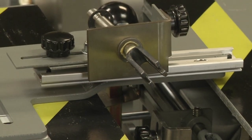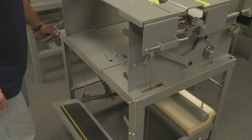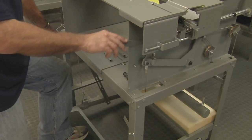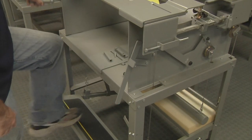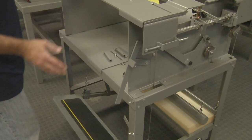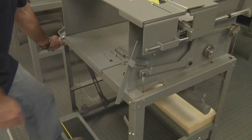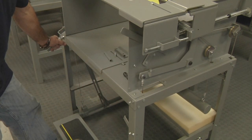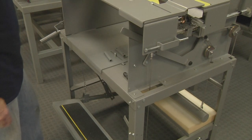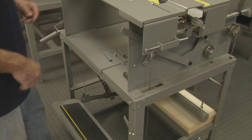This is a 24-inch manual racking machine. One last time, we'll go through the unracking process. For unracking: push the lever down for your jaws, push your foot pedal down, lift the unracking lever up, then release — and it minimizes the open position, it doesn't go all the way back anymore. So now you don't have to use a hand for the lever; you just use the foot pedal and use both hands for the unracking process.